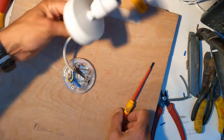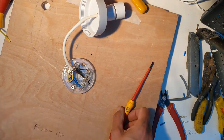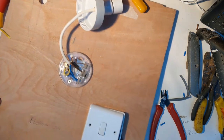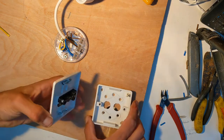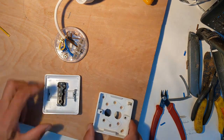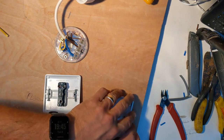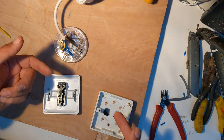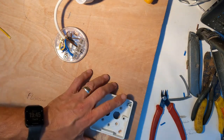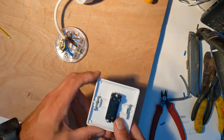You've got three connections to make to start off with: neutral, live to the loop, and earth. Once you've done that, you have successfully wired the power to a pendant light fitting. The next thing is wiring up your switch. First thing I'd do is screw the back plate of the switch to the wall — if it's a real wall you'd use raw plugs and a masonry drill, but here it's plywood so you can use self-tapping screws.